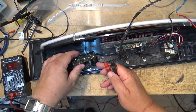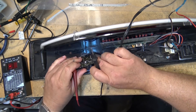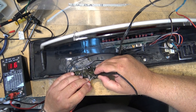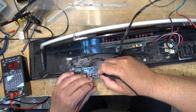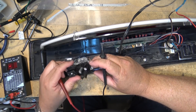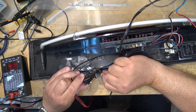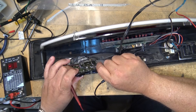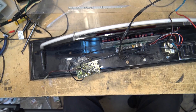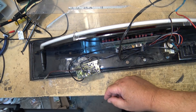The ESR meter has been zeroed out. I'll test the 10 microfarad 250 volt — as you can see it's reading 16, and this other one over here is 0.06, so the other one's okay. It's going to be this one that's bad. The other one is a 220 microfarad at 50 volts and it's fine. I know this is the bad one because it's been changed probably twice before — when it goes bad the display just starts to flicker and then it overheats and gets really hot.